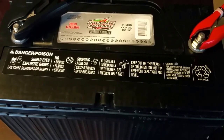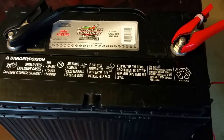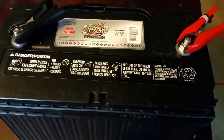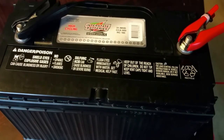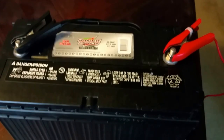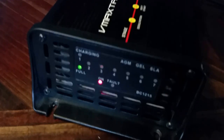You can connect two 6-volt batteries in series to get 12 volts, or more for 24-volt systems. If you want a 12-volt system, buy two 6-volt batteries; for 24 volts, buy four; for 48 volts, buy eight. Everyone has a different setup for their application, and that's fine — it depends on what you need and what you can afford.